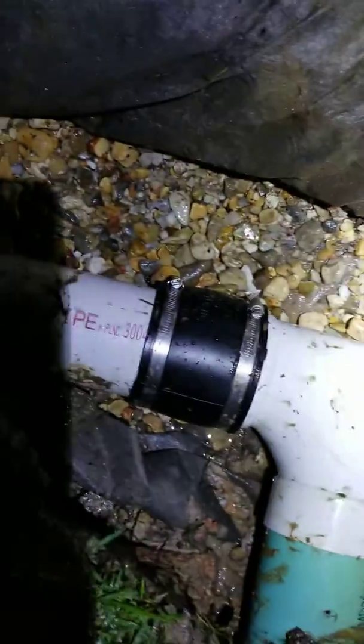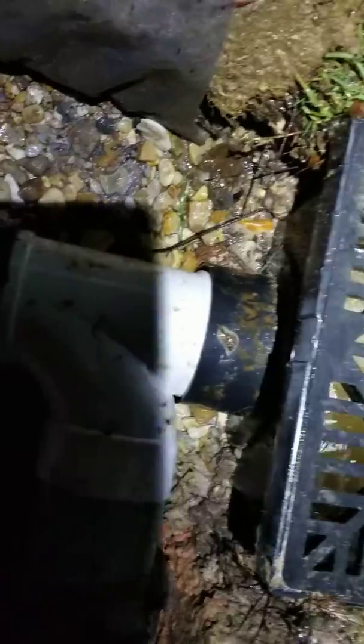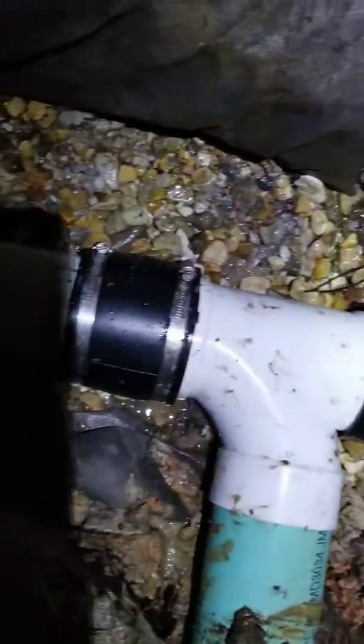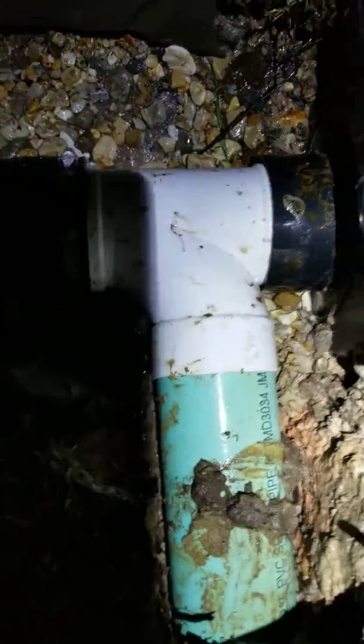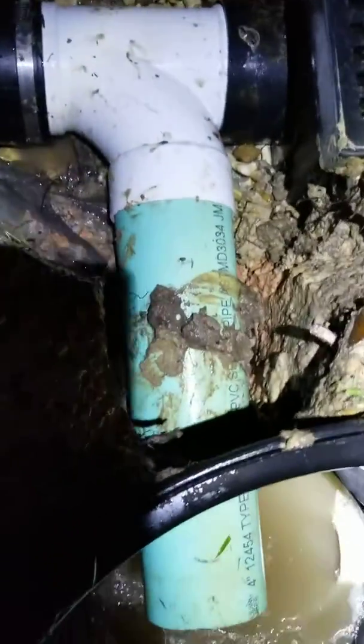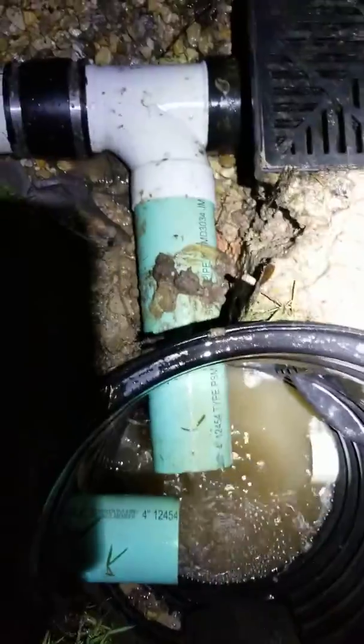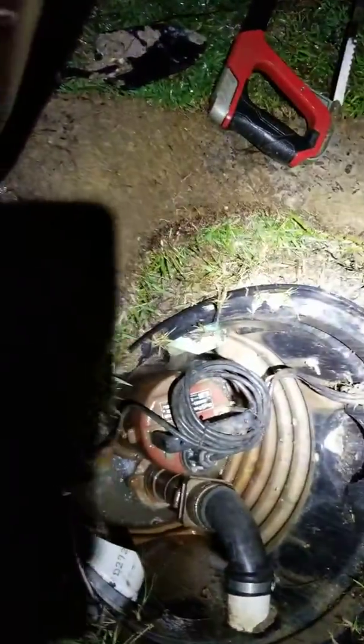You come through here and it starts choking up — it's a three-inch system. Then it can take this route, where it stays four-inch. But no matter what, it looks like it's always going to use both systems. What I'm getting at is, if we get enough water like we did earlier and this backs up...